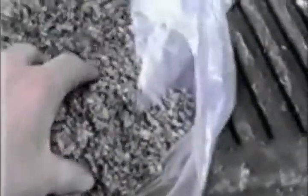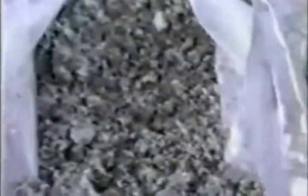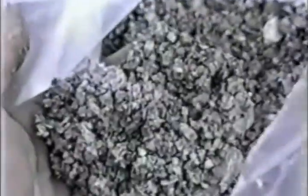What we've got here are the sample sacks from the last two holes drilled. These are the cuttings from the first hole using the standard water injection — this is a D2 Drill Tech rubber tire D40K, six and three-quarter inch hole. You can see the fineness of the cuttings and how that bit has to re-grind them with the available baling capabilities of the compressor. And this is the second hole — you can see there's quite a difference in mesh size of the cuttings; the encapsulation is very obvious.